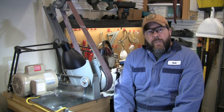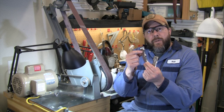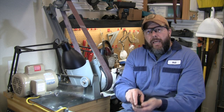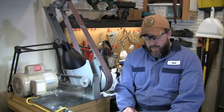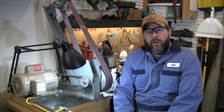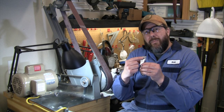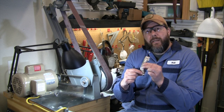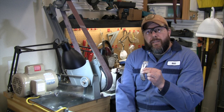And then the other piece we need to finish is the little cover plates that go on here. So there's little titanium cover plates that are going to go on there. Those need to be drilled and countersunk, and I'm also going to put the patent number on one of those. It was recommended that somewhere on this design I need to be able to put the patent number, so my plan is to put that on the cover plate that's going to go on the right hand side. So it's going to be on the back side, same place where the pocket clip is. I'm just going to go ahead and engrave that into that titanium cover plate that's going to go on there.